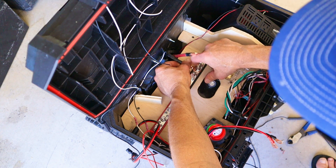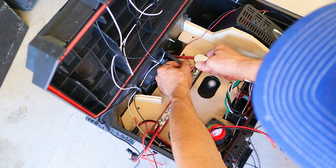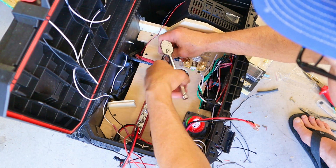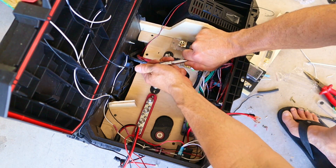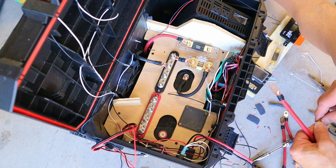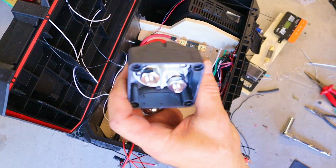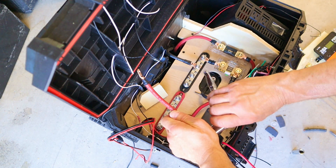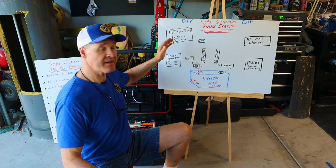Here I'm attaching the negative inverter wire to the negative bus bar. My system is not hot yet so there's no risk of a short as I begin wiring. Next I'm connecting the negative bus bar to the LiiTime battery monitor shunt and tightening down the lugs. Now I'm connecting the negative battery terminal to the other side of the monitor shunt. The positive feed cable for the inverter attaches to the 100 amp ANL fuse, and the other side of the fuse connects to the positive bus bar. All power runs through a master shutoff switch installed in line between the positive battery terminal and the positive bus bar. All number 4 gauge wire is installed and the inverter is hooked up.